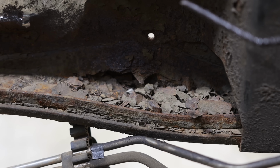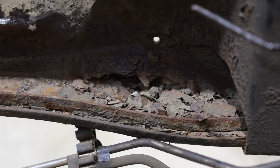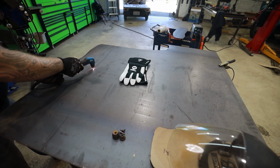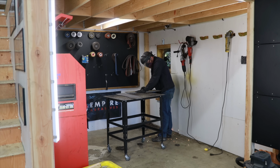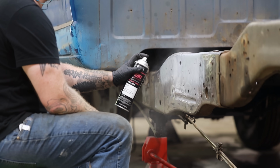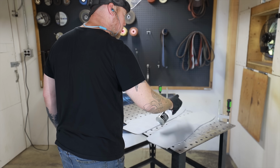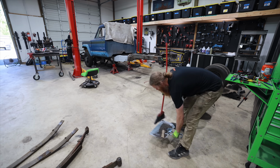Almost right away, I saw a giant rust section that I did not see before, so now we're gonna make this fish plate span a much broader distance to go past this rust section, so we can do our best job to repair it, but we're not going to rely on this for structural integrity anymore, because we're going to be able to sandwich up and get a little bit more strength with this 3/16 plate that we're going to run on this long span.